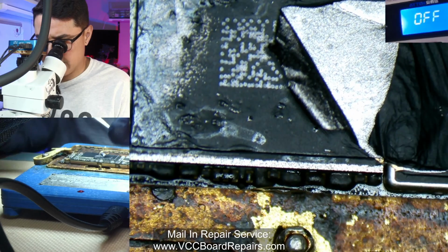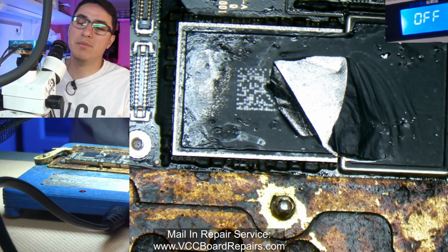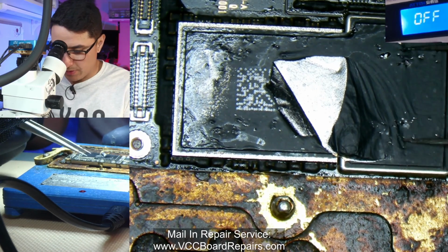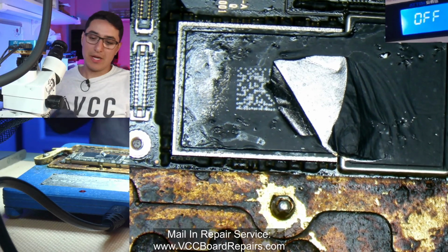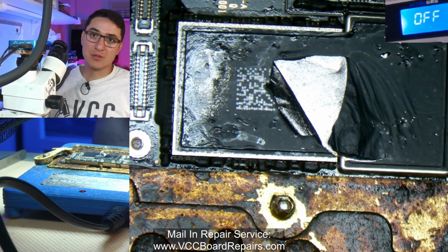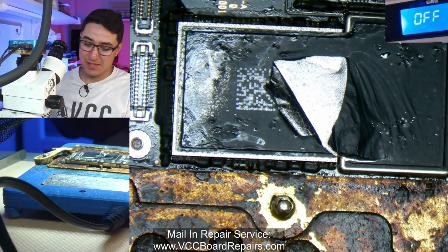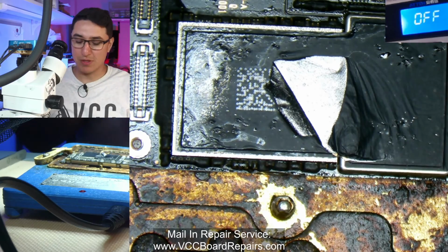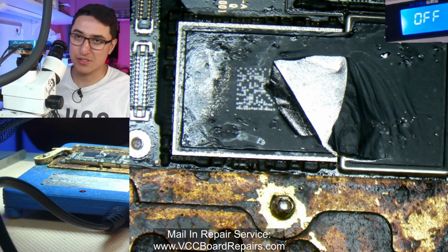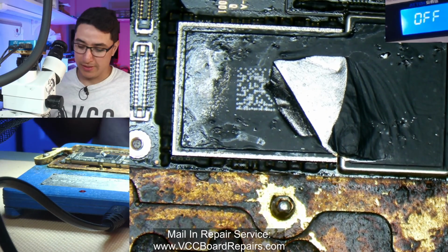So the thing is, the sandwich solder joints from the factory are low temp, they're 138 or 148, somewhere around there. That's basically why I had to split the board to work on it, because since it's low melt, it's really easy to separate the boards and mess it up. I actually have a full video on that, where I experiment to see, can I remove the shield without splitting it? And the answer is no. At least not in a practical way.